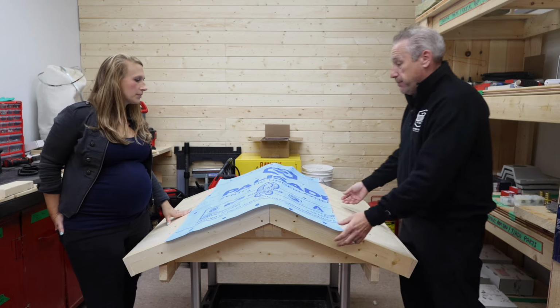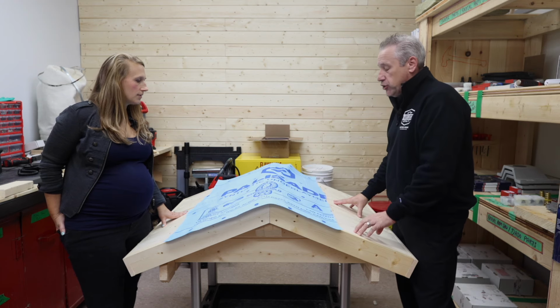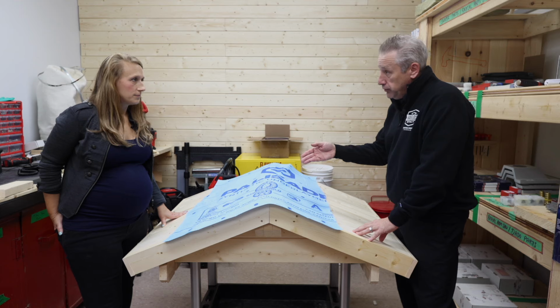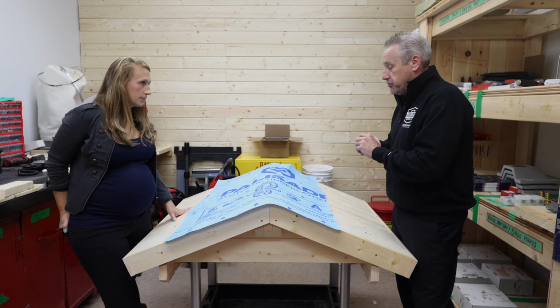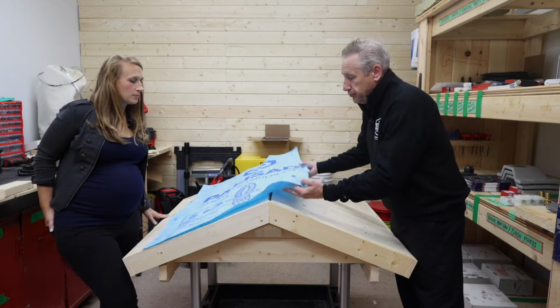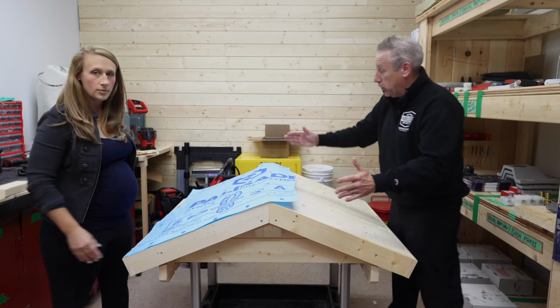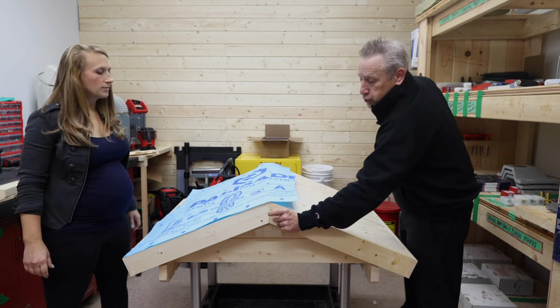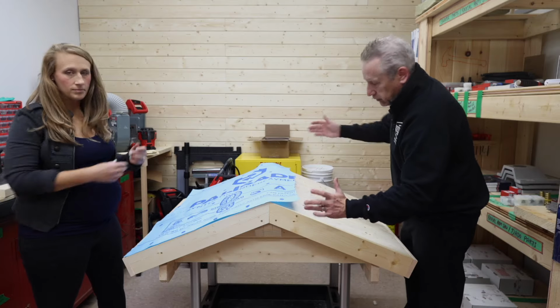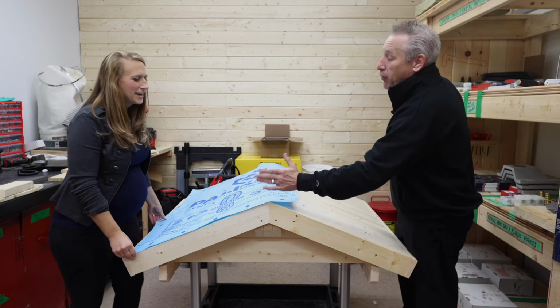So basically it comes as you see it here, and it's fully walkable. How you'd mount it, generally speaking, would be through a staple to hold it in place, and then you'd cover it almost immediately with your strapping. What would happen is you'd have it lined up, start in the corner on your roof. We're going to cut it in sheets that are long enough to cover the run. There may be a few inches of overhang, just in case they cut a little unsquare or the bunkie is out of square, likely never. But if it did, that's why we have a little bit longer there.